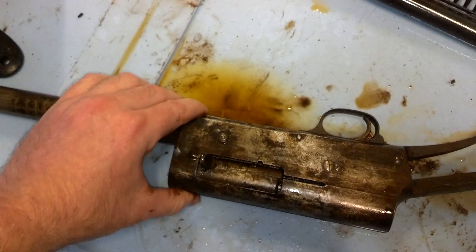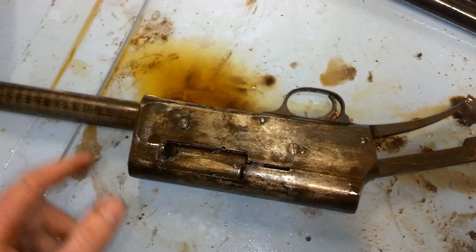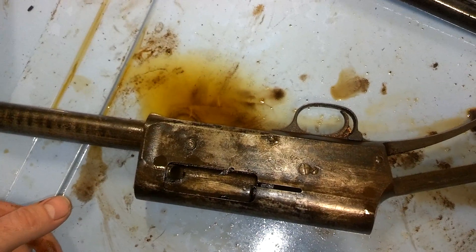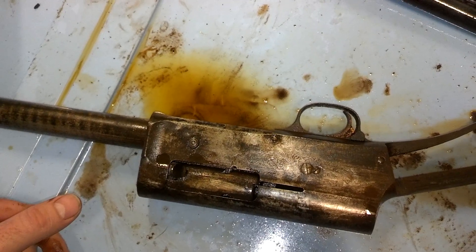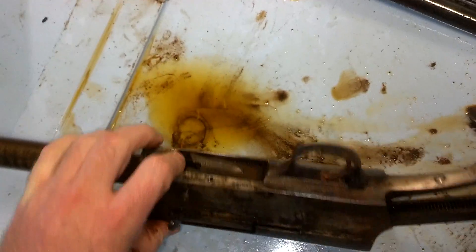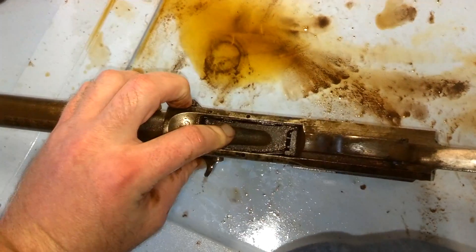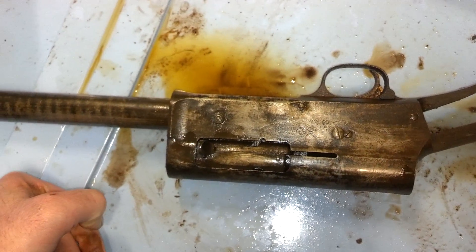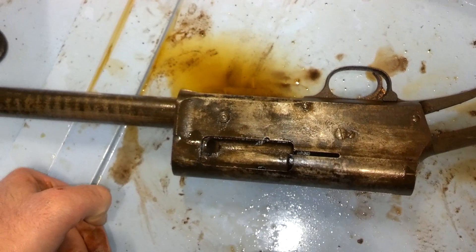The internals might not clean up with the electrolysis, but there's not much we can do — we just need to get the screw heads off. This should go a little ways down the road to making that happen. The stuff inside might break loose a little bit, but as we've seen in some of the other projects, things that are inside other things — inner surfaces — tend to resist electrolysis pretty well. So I'm kind of curious to see just what the exact result is.